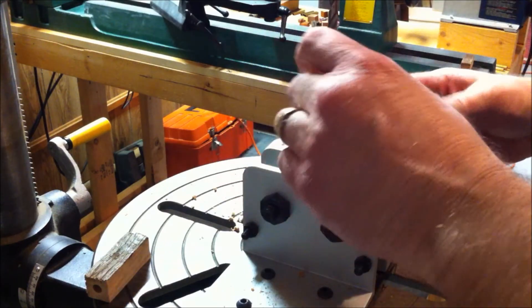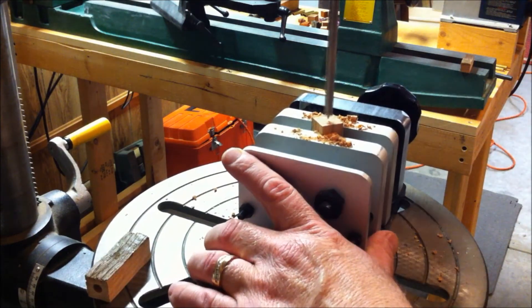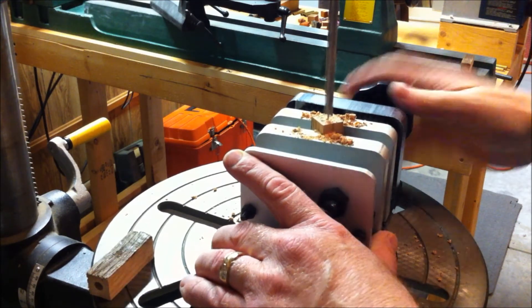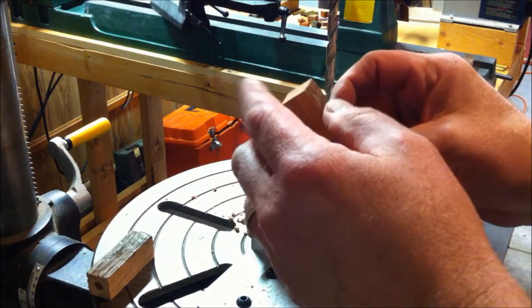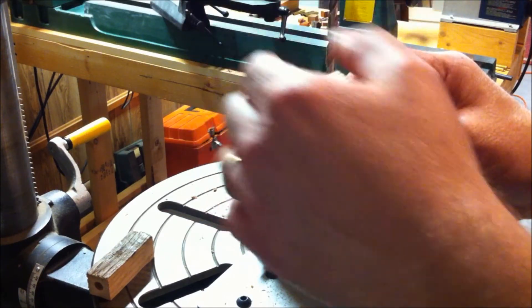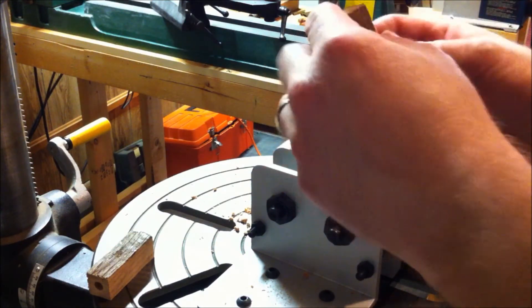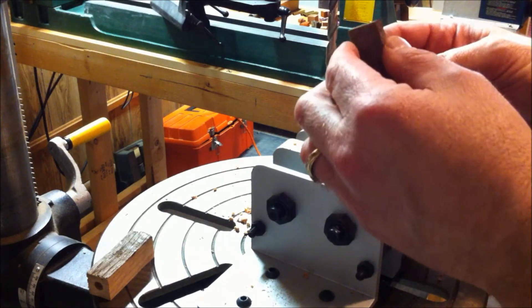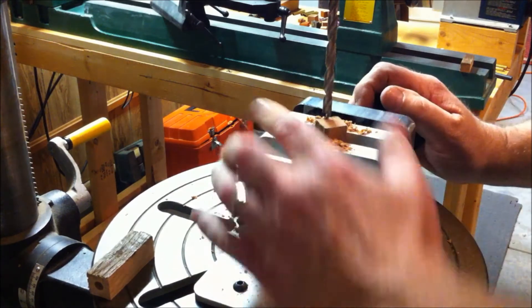Find the perpendicular line and clamp it in there. I'm noticing something here — this blank is actually cut at a bit of an angle, it's hard to see on the video. My drill bit is actually dragging to the right as the brad point hits it. That's not a good thing, because it's going to draw the bit off and go through the blank on a diagonal, coming out closer to the side as opposed to the middle. So I'm going to adjust for that and flip it over and drill from the other side.